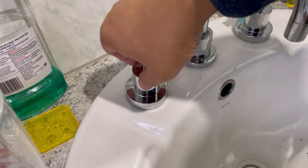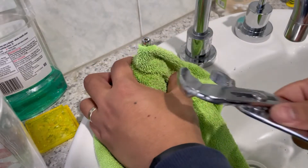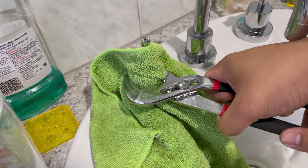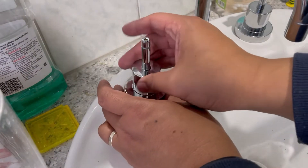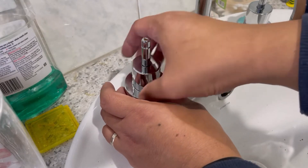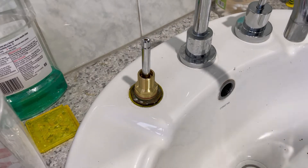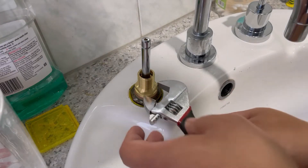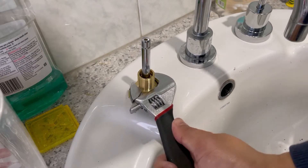Take note of the position of the nut. This may be tight to turn with your hand — alternatively if it's too tight to undo by hand, you can use the old microfiber cloth and the channel pliers. Unscrew the base — this should expose the locking nut. Now I'm going to get the adjustable spanner and undo the locking nut.